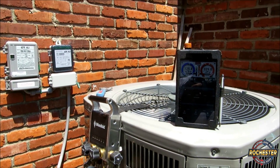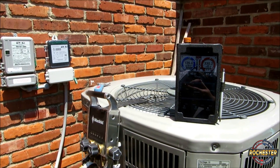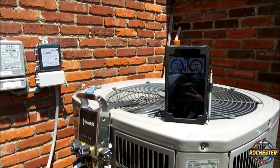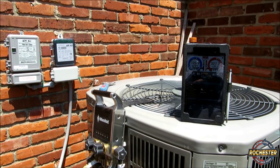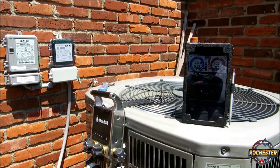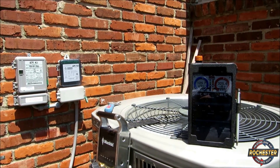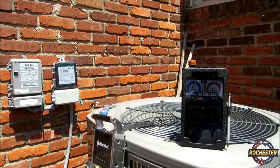I just wanted to test it out — I maintain all this equipment — and basically what I wanted to do is see how it was running today. So after we fixed downstairs and got everything up and running, I just wanted to sit with it for a bit. I got out my Testo 435 and I checked the airflow and I checked my CFM. We all need to be doing that, guys. No matter what instrumentation you're actually utilizing, we all need to be checking airflow. If we're not doing that, we're not doing right by our customer. Everything in air conditioning revolves around airflow.